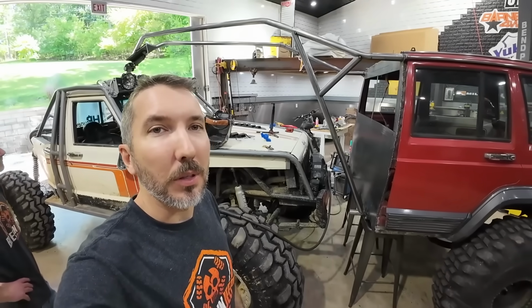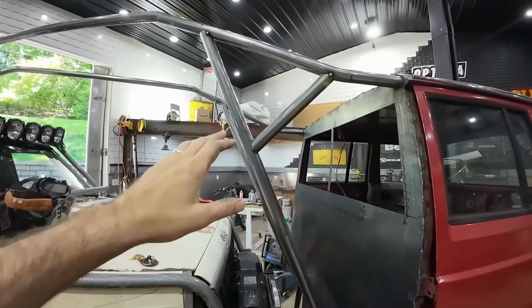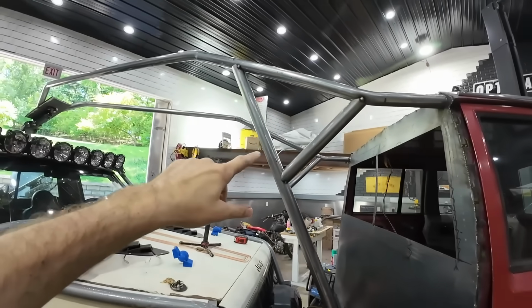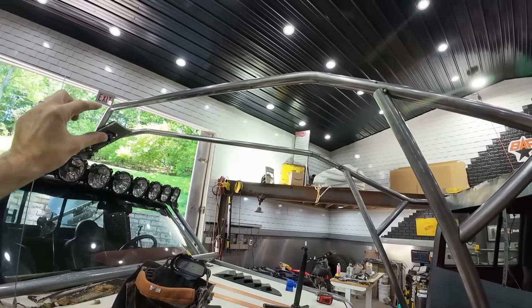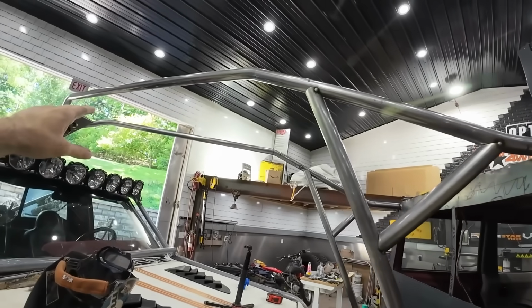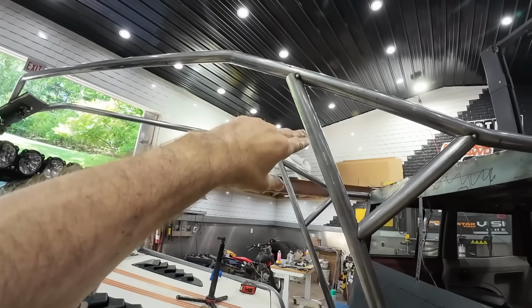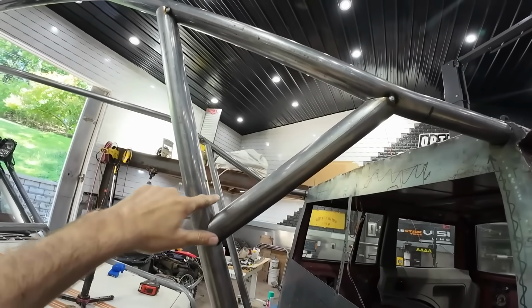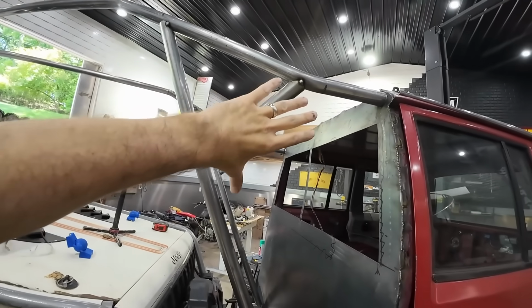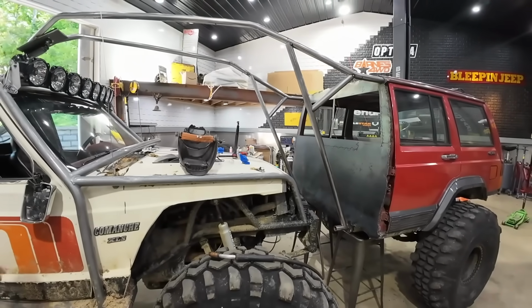All right, we're using CAD brain engineering. What that means is we're just looking at this, trying to figure out where the weak points are going to be. So obviously when you do cage work, you want to do triangulation. So we've got a triangle there, sort of a triangle here. And now we're going to create a ladder bar going up here. The weak point right now is that single tube. We're going to make that a double tube with ladders coming down. I think what we're going to do is have that come off of that plate, horizontal with that tube, bend right under that bend, and then come down slightly more here. And then we'll have a plate made, like an 1/8 inch plate, to fit right in there to strengthen that section. That makes all that really strong and transfers. Probably the weakest portion then is going to be right in here, but I think it'll be strong enough based off of my CAD brain design.